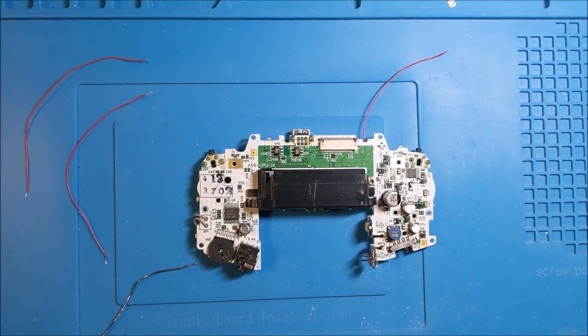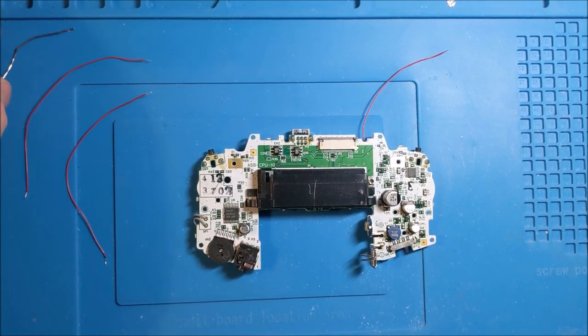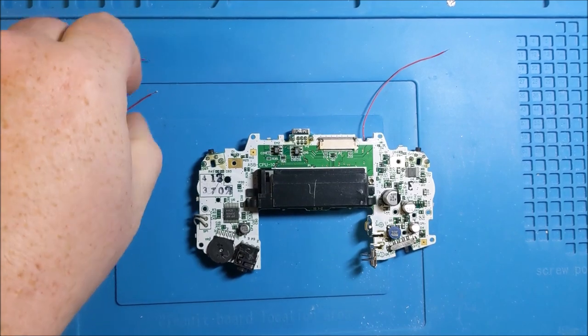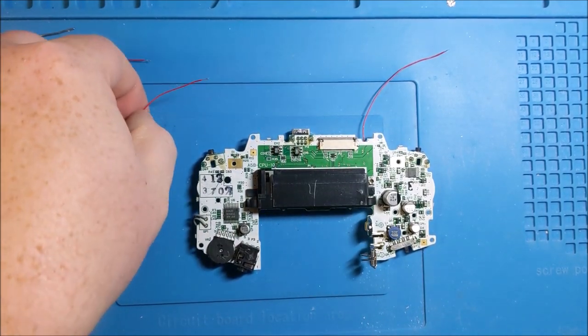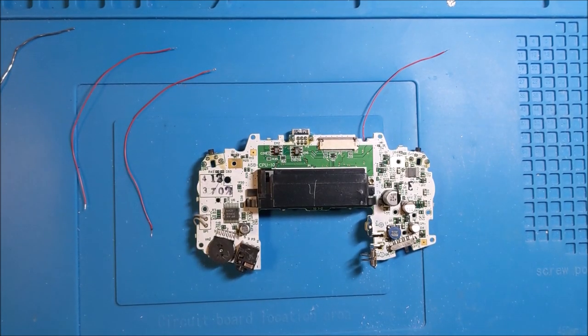And as you can see, soldering is one of the hardest things that I tried to get a hang of right out of the gate, because a lot of these little tips like tinning your wires and keeping your heat down, like obviously you can see 250 degrees has been plenty. Without having someone to just watch what I was doing and be able to look over my shoulder and say, hey, I never would have known any of these things. So I learned that as I made mistakes and then was advised by people more experienced than I. So that's really the best thing we can do is just try and take any of these lessons and apply them and then pass them on to others.